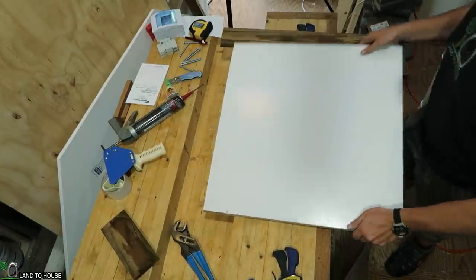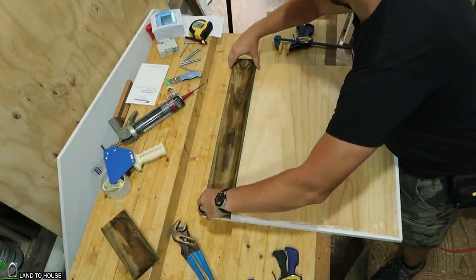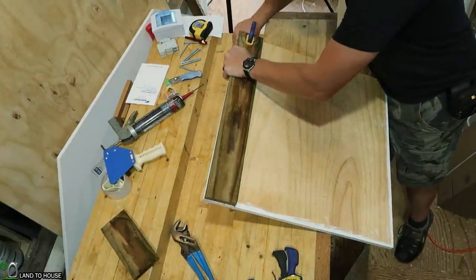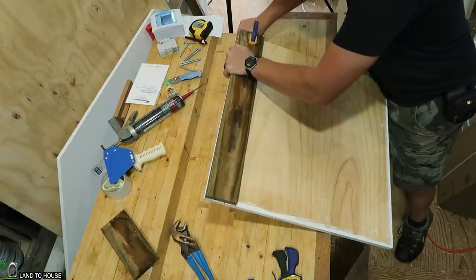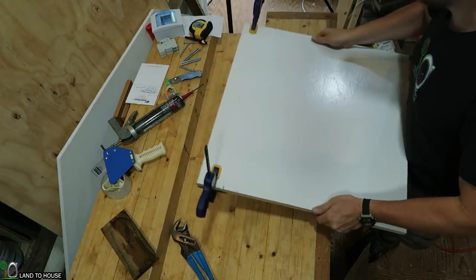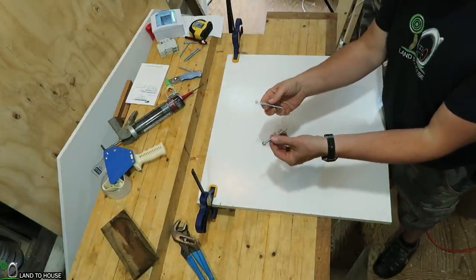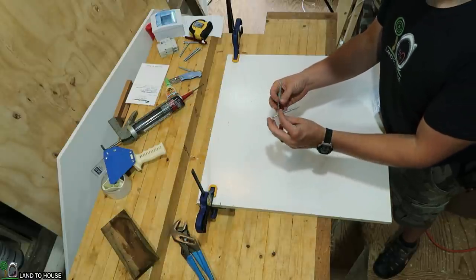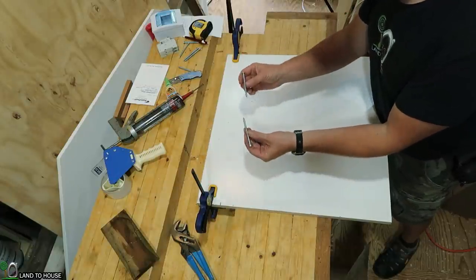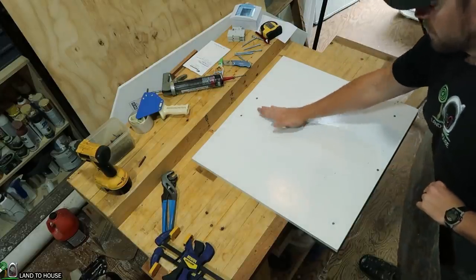With my 25-inch piece of treated board, I'm going to flip this over, stick it to the back, and then hold it in place with a couple of clamps. I can flip this over and put a couple of screws in there from the top to hold this in place. Later I'm going to be using these anchors that are prepared for concrete — they are a coated screw — and that will go through both the plywood, that 1x4, and into the concrete wall.